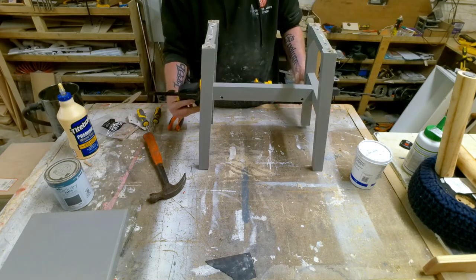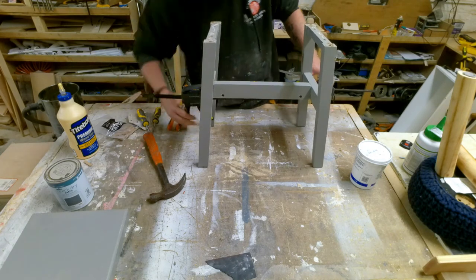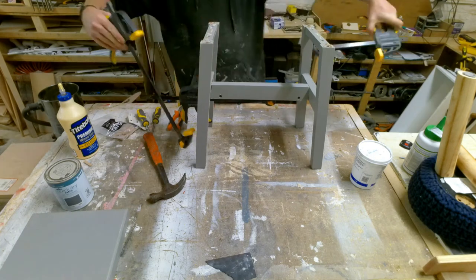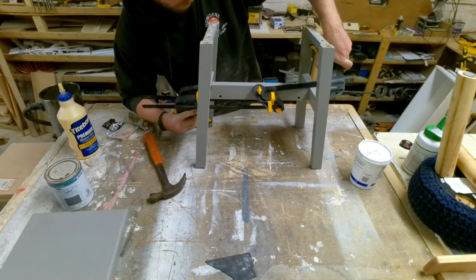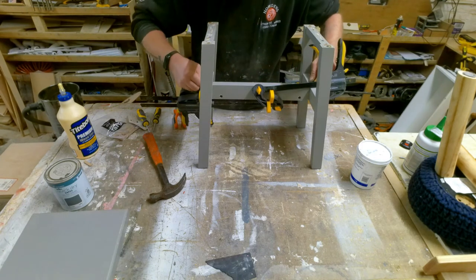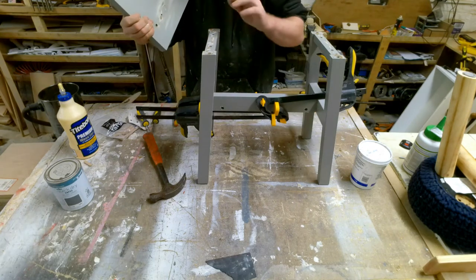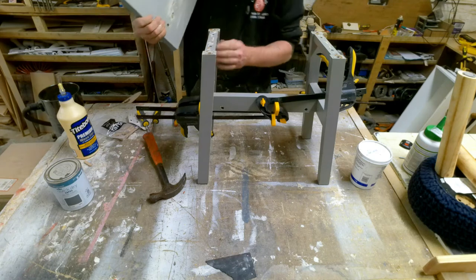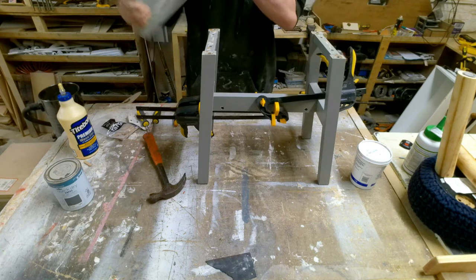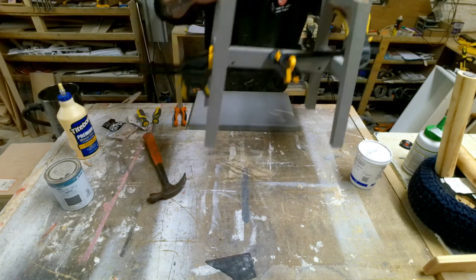If you don't have a clamp big enough you can use two clamps. I'll get the same on the other side because it's twisted. It would be a whole lot easier if I had one clamp big enough — I think it might be time to buy some. The top came off because there were zero dowels holding it, so now I'm getting a couple of dowels in there so when we put the top on it'll be glued nice and square properly. Set this aside to dry.